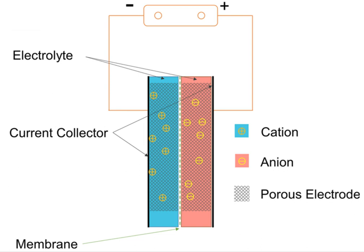Operating voltage. Supercapacitors are low-voltage components. Safe operation requires that the voltage remain within specified limits. The rated voltage U_R is the maximum DC voltage or peak pulse voltage that may be applied continuously and remain within the specified temperature range. Capacitors should never be subjected to voltages continuously in excess of the rated voltage.